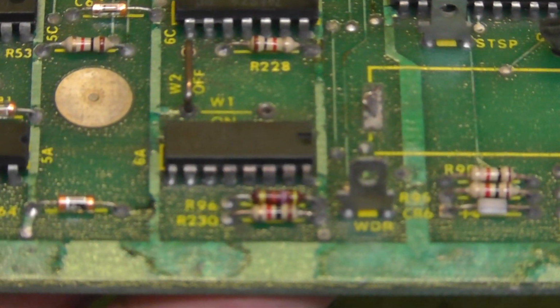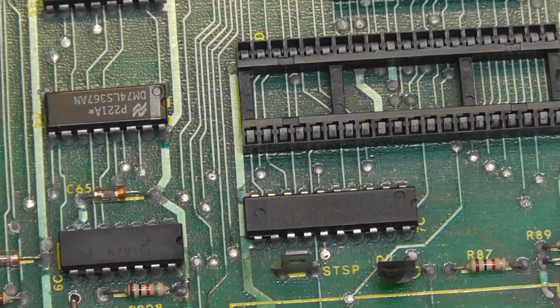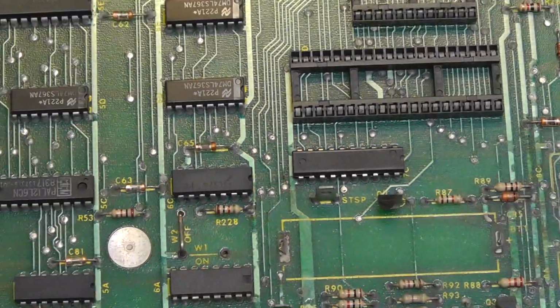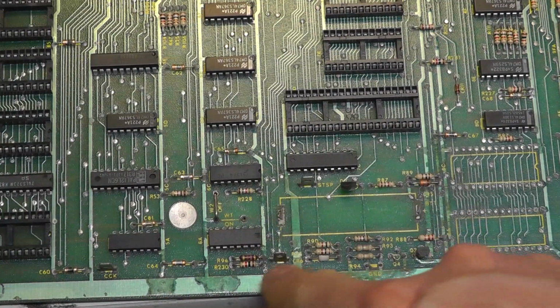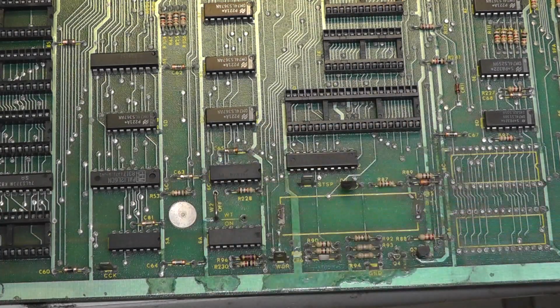This had so much corrosion, this chip here, dang, you can't really see it, that it's kind of lost its tin. Like, you can see all the way down to the copper now on those legs from the toilet bowl cleaner and removing the base. So, but yeah, you can see this discoloration. I'm gonna have to get sandpaper there and try to get into these resistors and stuff, this whole area.